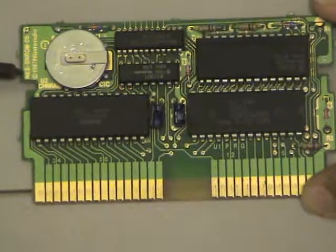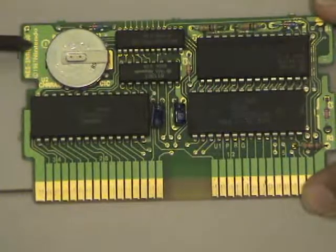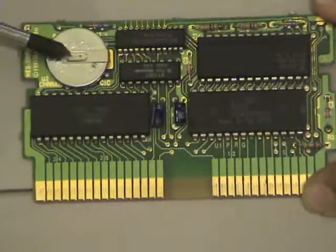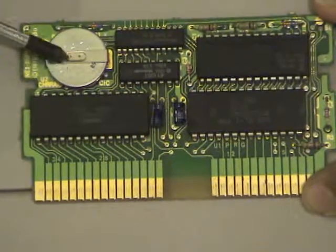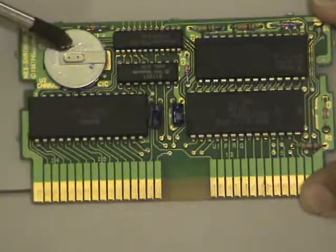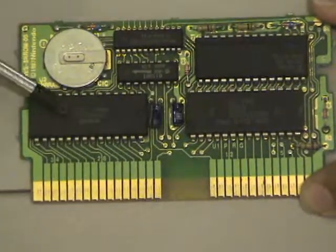On the side, you can actually see its NES has an SN ROM, and it has the production date, Nintendo. Here's our battery backup for our save games. This battery can actually fail at some point. You can take a soldering iron to this and replace it with a standard PC battery. If you want, you can even put it in one of those BIOS battery clip holders, so you can replace the battery whenever you want.